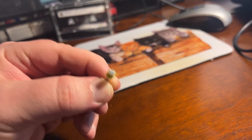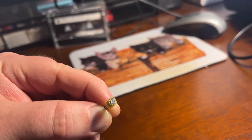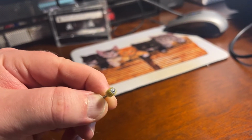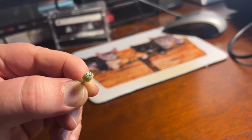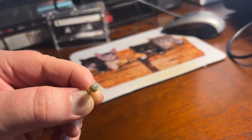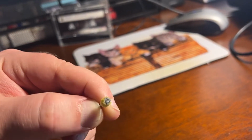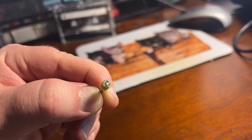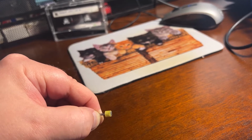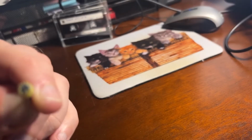I forgot to show this. This is that gear that was broken on the Blockbuster. This gear comes off of the flywheel and drives a pulley, and that pulley is driving the auto stop mechanism and the idler with the rubber tire that drives the take-up reel during playback. So this is the second most common failure I'm noticing. The plastic shrinks with age. When it does, it cracks. And because it's around a metal piece, when it shrinks, right where the crack is, the two teeth open up.